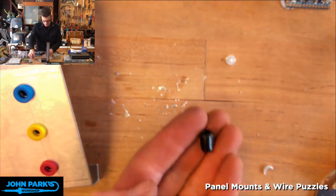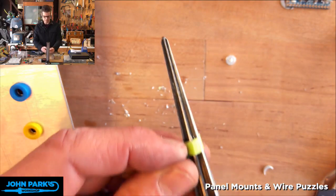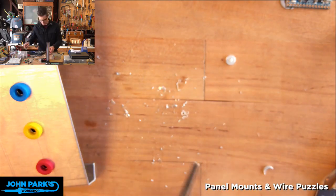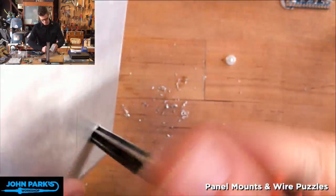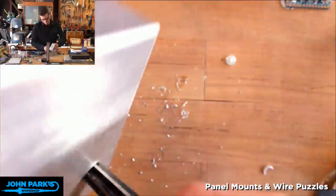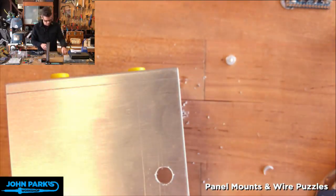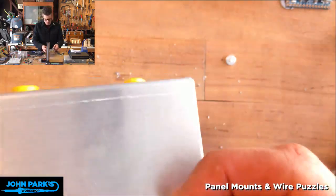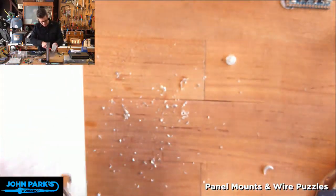This is the holder. This is the jack. So I'm going to have to ream quite a bit farther. I don't need this piece of tape anymore either, so I'm going to just do both of these through the trial and error process. Watch out, these reamers are sharp. It's basically a bunch of knife blades sideways. Let's see how that is. That's good. I actually made it too big. Awesome. Let's see if I pull that burr off, if it'll sit flush. I got aggressive with the reamer.